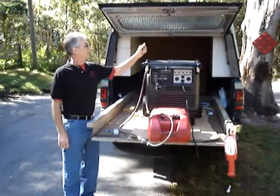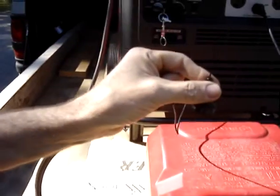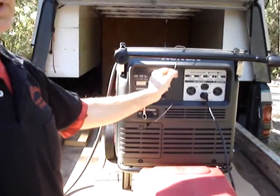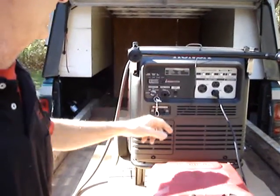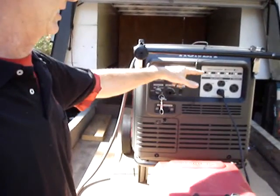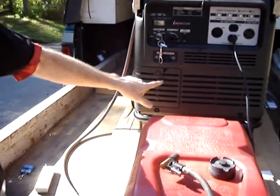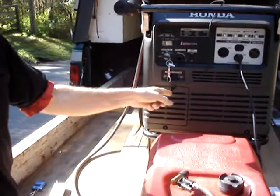One thing that I forgot to cover when we were inside is that this radio kit has an external antenna with a magnetic base, just like the CBs that were so popular in the 70s. This wire is a shielded cable. Do not cut this wire under any circumstance. It'll destroy the SWR, so your antenna will give you less range if you try to cut this and then resolder it back together. The way I've got it routed is coming out through the little hatchway that Honda puts on the battery cover for Honda's wired remote control to plug into.